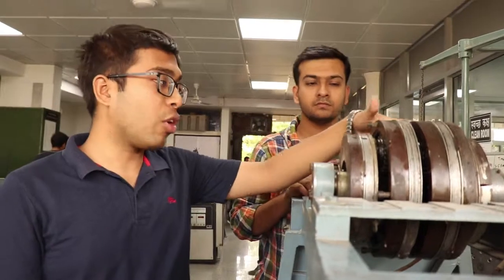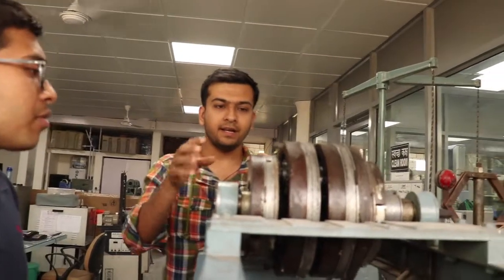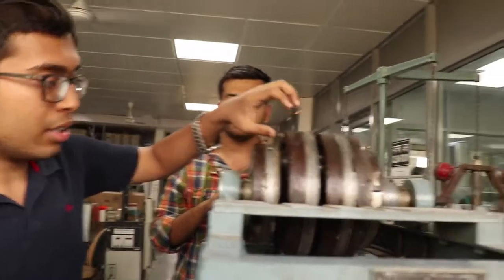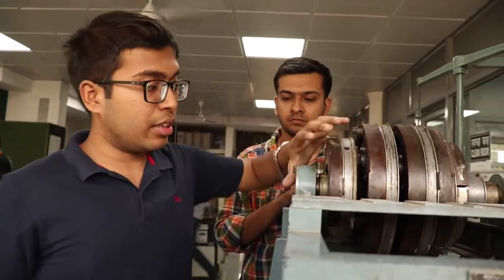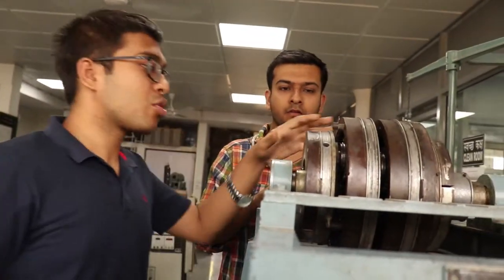The compound epicyclic gear train has four degrees of freedom because of the four different assemblies. We cannot have all assemblies working simultaneously, so we keep one assembly fixed — it might be the planet carrier or the sun gear — and from there we change combinations for different gear outputs. Any one assembly can be locked and the rest can be managed to obtain the output rotation. The sun gear in the first assembly has 20 teeth, the second assembly has 25 teeth, the primary gear has 25 teeth, and the main ring gear of both assemblies has 75 teeth.